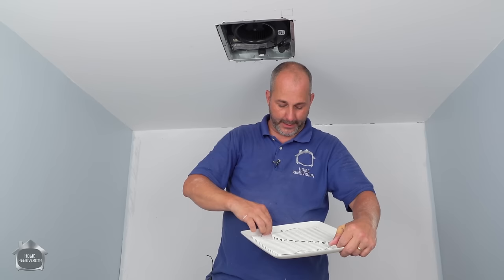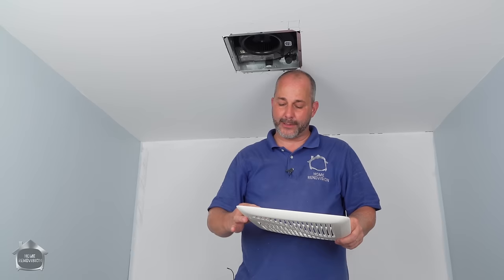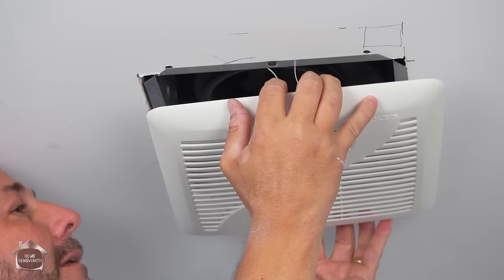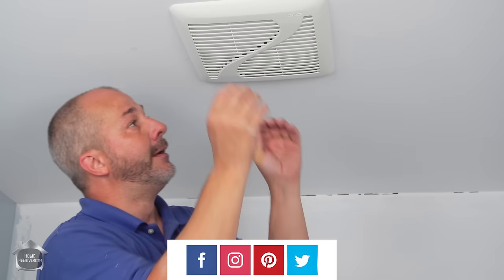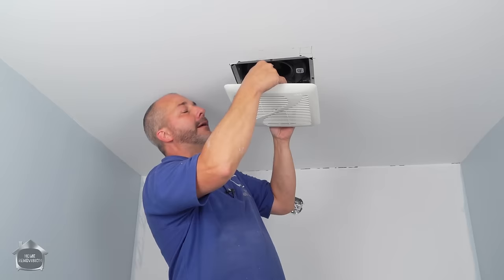I'm going to do one more coat of paint on the ceiling to cover up all my pencil marks. When I'm installing a fan, I always like to do one coat of paint before I'm finished. We pinch all of these wires under compression and put it on each side — that pulls it up to the ceiling and all those screws and everything else are covered. I can move this around a fair amount if needed. If you have any hole exposed, just try moving your fan housing around. If you ever need to do any maintenance, simply take the grill, pull it down, pinch the wires together, and slide it out. If you'd like to see how the rest of this bathroom turns out, click the video right over here — it's a playlist for all of the elements in this custom walk-in shower bathroom. You're going to love it — see you next time.